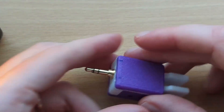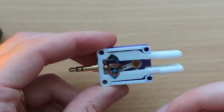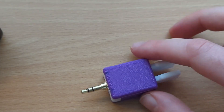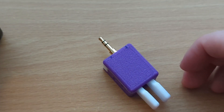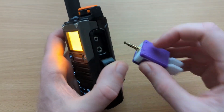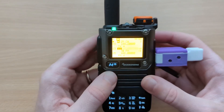For CW, I bought this paddle from AliExpress for a couple of bucks. You can see there are two resistors in there — a 10K and a 20K. The online diagram isn't super clear, but the 20K resistor goes to the DIT paddle and the 10K to the DAH. If you're using a straight key, I think it just needs a 10K. It just plugs into the port on the side of the radio.